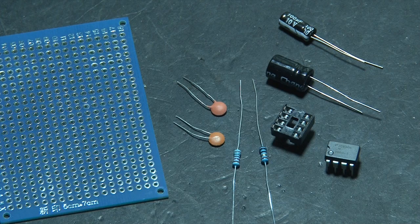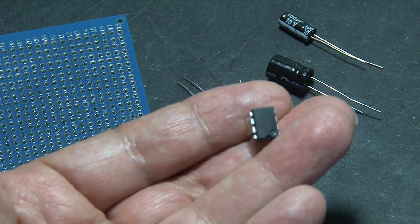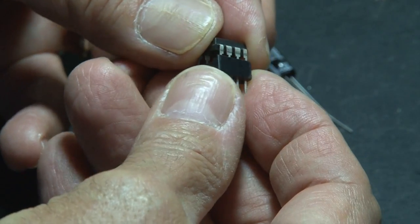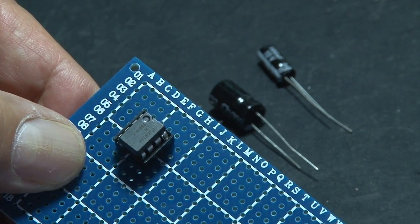To make the DIY Mini Digi speaker, you're going to need a few components. You'll need some resistors, capacitors, a small circuit board, and the brains of the organization: an LM386 chip. This is actually a low-voltage power amp. It's pretty versatile. The first step is to put it in a socket — just in case anything ever happens to it, it's easily replaceable.